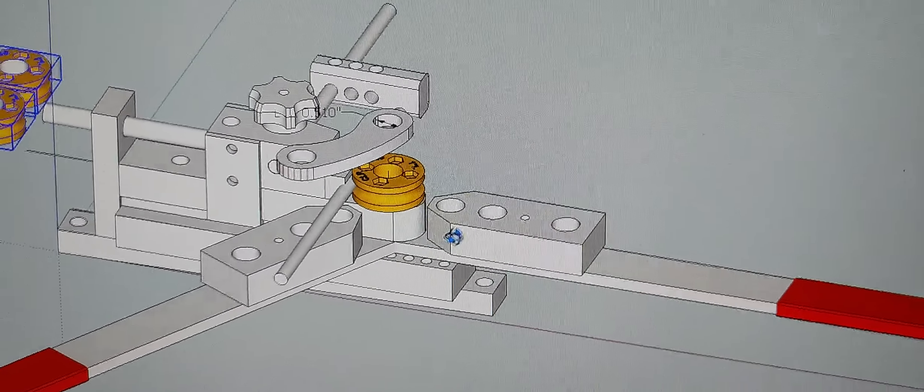I reverse engineered the formula for figuring out the length of the curvature, and I started with the actual length — I wanted to make that a standard one-inch length for the curvature. So the die is designed in a backward format using the formula for figuring out the length of the curvature for 90 degrees. You can do that for any number of degrees; just interpolate the formula.